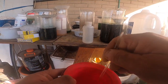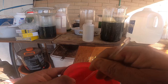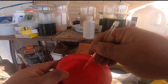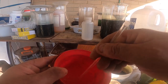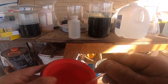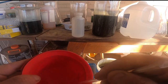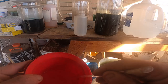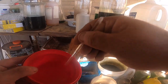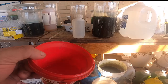The solution has been well filtered — it would be nice and clear if it was a cleaner solution going through the filter paper and cotton balls. I've dissolved some SMB in water here, just stirring it up to make sure it's all dissolved. Normally you would double the quantity of your solution because gold likes to drop from a diluted solution, but this solution has already been diluted a lot with all the rinses, so I don't need to double it.